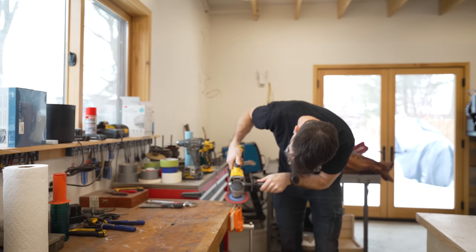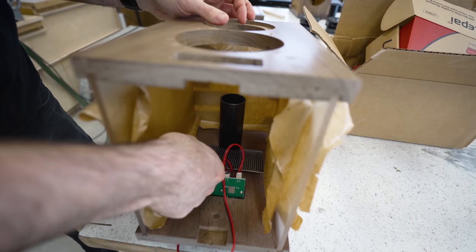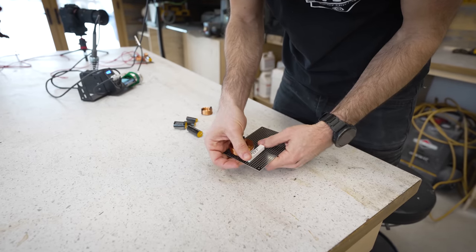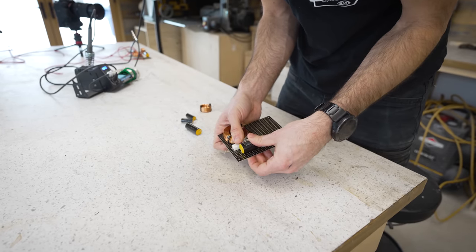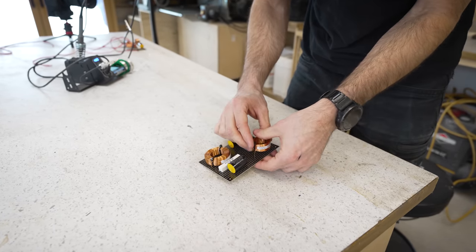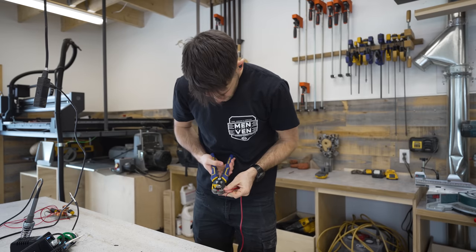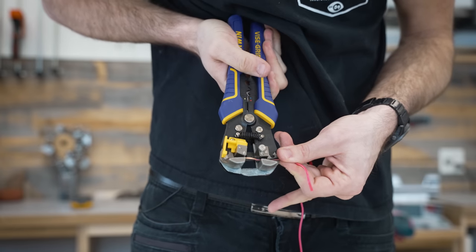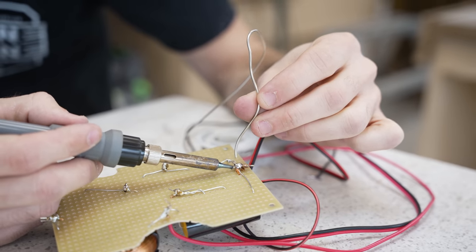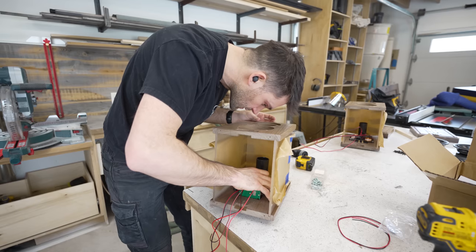I used an angle grinder with an abrasive disc to grind off the parts of the crossover board that I didn't want anymore. After I did that, it fit quite nicely. For those of you who don't know what a crossover board is — this was actually my first time using one too. It's just a small perforated board, but those perforations allow you to pull the leads of the various capacitors and resistors through the board and then tie them together on the opposite side. You can then solder them, trim off the excess, and what you're left with is a really clean crossover that can easily be mounted inside the speaker cabinets. I also got these automatically adjusting wire strippers — just feed the wire in and you're ready to solder. After getting those speaker leads soldered in place, I mounted the crossovers on little isolating rubber feet under all four corners and then screwed them down.